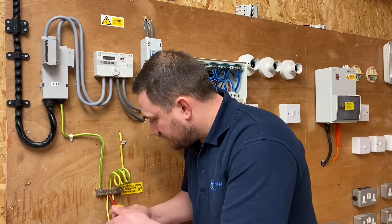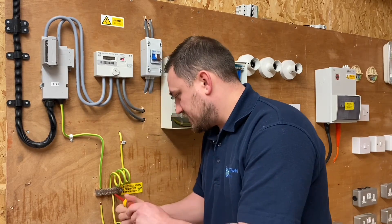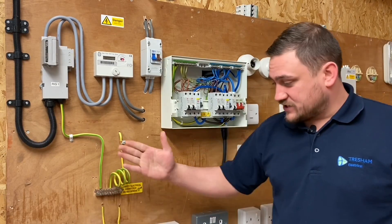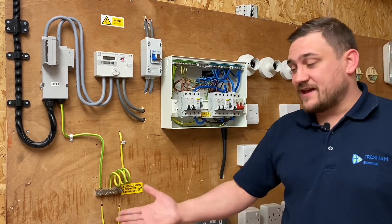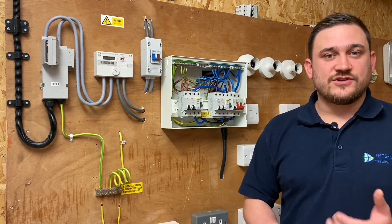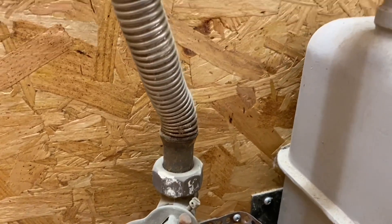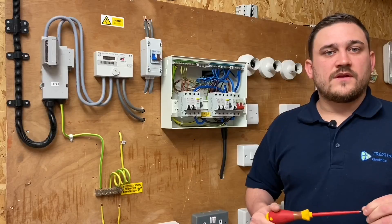I need to remove these paths because I'm actually checking that my earthing conductor is connected to the greater mass of earth through the DNO supply. If I had these connected, when I do my test I could actually be getting a reading off a metallic gas or water pipe - one that could later be changed for plastic - and then all of a sudden we don't have a connection to the greater mass of earth. So the incoming water or gas is metallic and therefore connected to the greater mass of earth, so we're removing that parallel earth path.